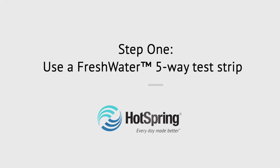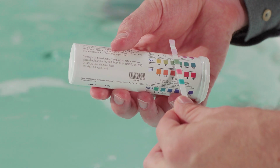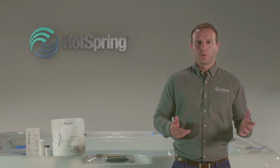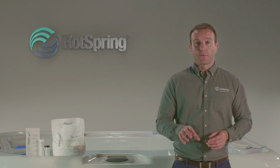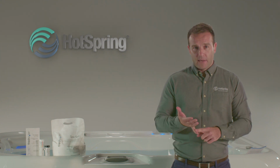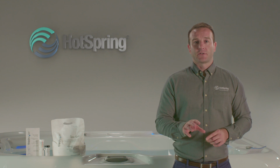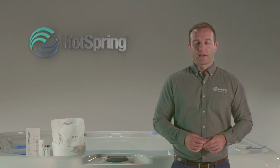Step 1 is to test your spa water using a freshwater 5-way test strip. It's important that you use the freshwater brand of test strips to ensure that you are adjusting your water into the OK ranges that are safe for the freshwater salt system. Use a test strip to measure pH, alkalinity, and hardness. Follow the instructions on the bottle to adjust your pH and alkalinity into the OK ranges.